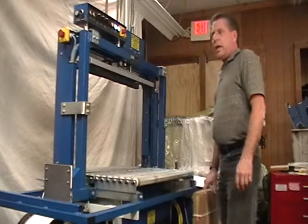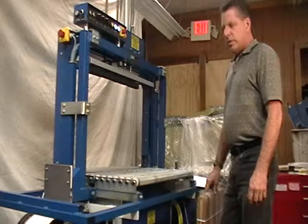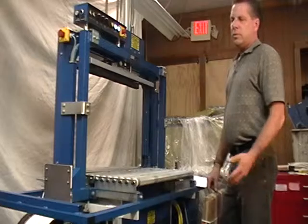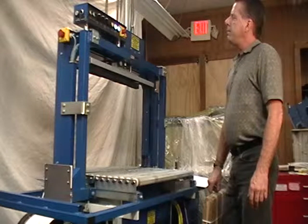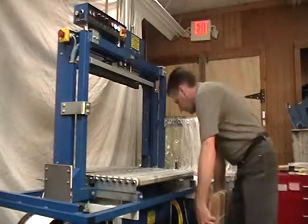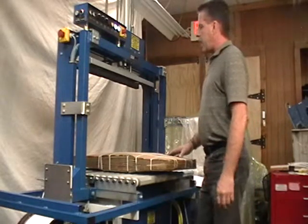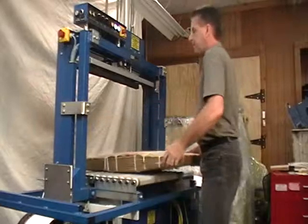The machine currently has 1.727 million cycles on it, and that represents about 17% of the machine's lifespan, maybe 20%, because these machines go 8-10 million cycles easy. So this machine has a very small amount of its lifespan used up. It's also been converted to use 5mm strap, which is a nice option that gives you the maximum amount of economy in the strap.